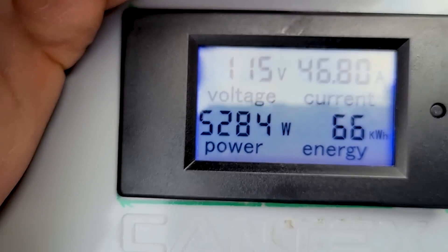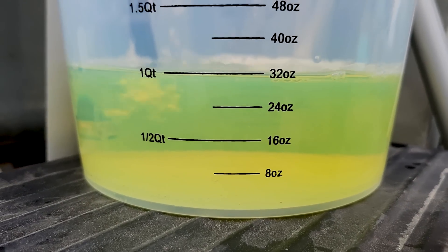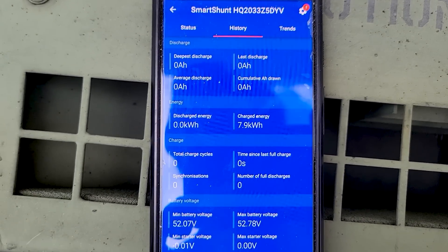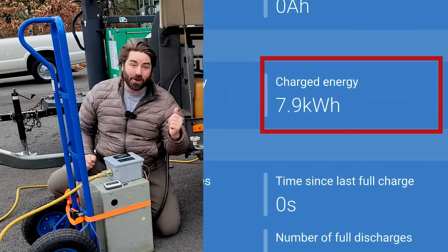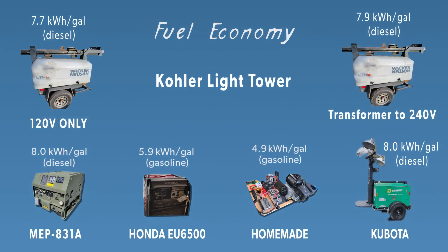This has been working out excellent. We've been maintaining good voltage — an hour and 41 minutes — and it looks like we're good to go. We got 7.9 kilowatt hours per gallon. Wow, we actually did better! That means it did better running through this transformer than before when I had two separate charge verters. Is that what you expected? Because I did not think it was going to get any better — I thought we were either going to get the same result or a little bit worse. Please let me know in the comments below.